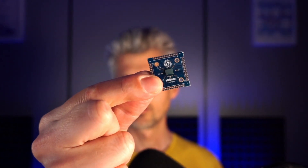In this video I'm going to show the process of how I'm soldering the chips that we got from the MPW2 tape out onto these PCBs, so we end up with something like this. Then we put that into the test jig, characterize the problems we've got with the GPIOs, and then we can go through each of the designs that taped out on the Zero to ASIC course MPW2 tape out.